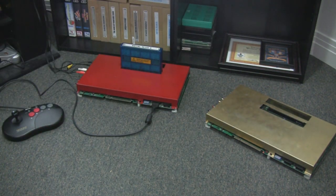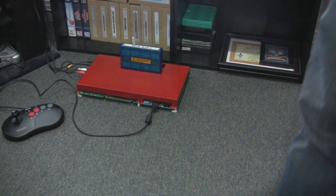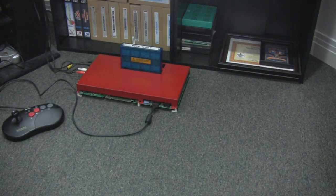Now in order to do this, a lot has to be changed. For one, the video outputs RGB — red, green, blue — and we have to convert that to an NTSC signal for television, at least in North America and Japan. For that I've used a really inexpensive converter or encoder. It's called a YA-CV04.